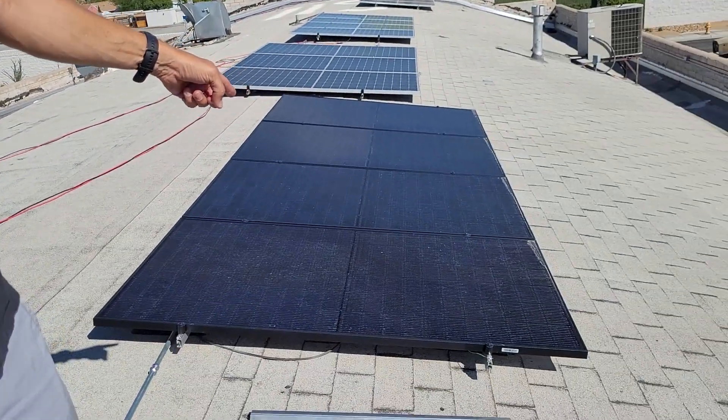On these peak condition days you need about 1500 watts, because you lose some efficiency from the panels — they're probably 140 degrees right now on this roof, so you lose about 15%. The compressor of air conditioners also becomes less efficient in the summer. Better to over-panel a little bit; in the spring and fall you won't have problems with just a thousand watts, but since panels are relatively cheap, we recommend 1500 watts.